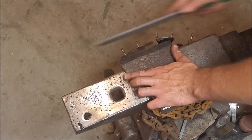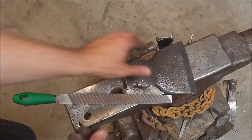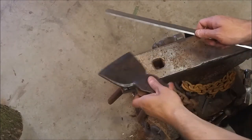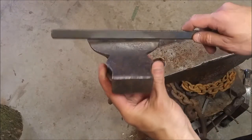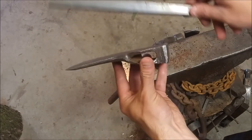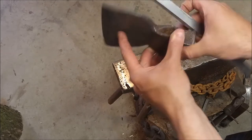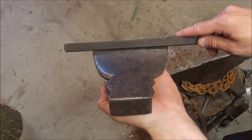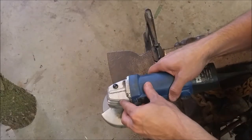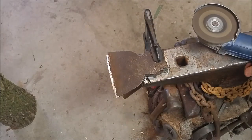There we go — there's a really rough shape. So typically you do this if you want a good reference edge to work to. I use this old planer knife as a straight edge. What I wanted to try and show here was that there is actually a crown that we need to keep — this particular hatchet was designed with that, and I think it's actually fairly well designed. There's also a crown on that front edge that we'll try and keep; it's very minimal. So I don't like to use the angle grinder if I can avoid it, but because the pitting is so bad, I decided to use it.